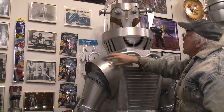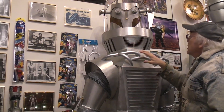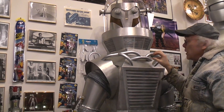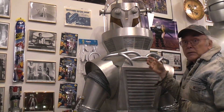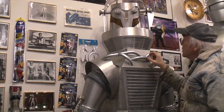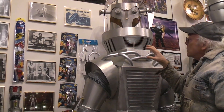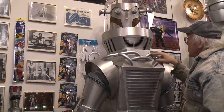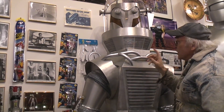In the original Tobor, these were aluminum pipes. If I bring the camera in closer, you'll actually see little screw heads where the original pipes were basically all held together with 2-56 screws — in America it's a number two screw, 56 is the number of threads per inch, it's called a 2-56. Quite long, holding all the bits and pieces together. This would be one of the molds that I made, so in my case this piece is resin cast from the original, and it's screwed on but not with 2-56.